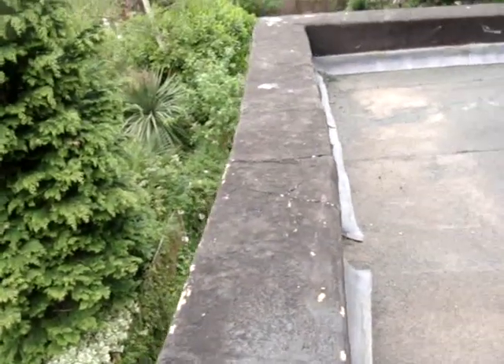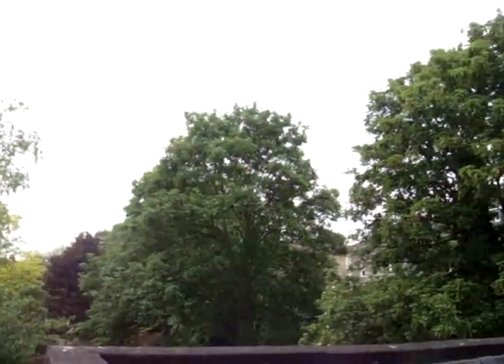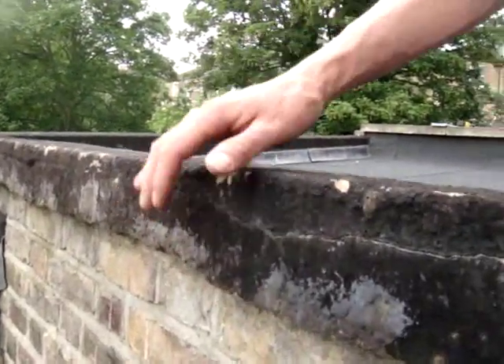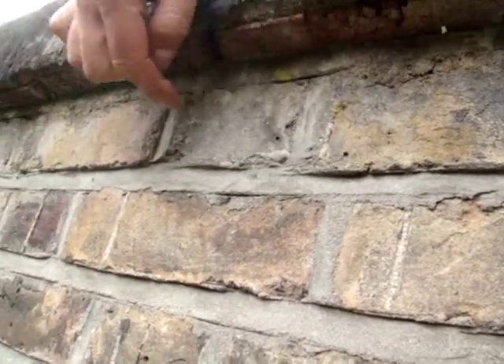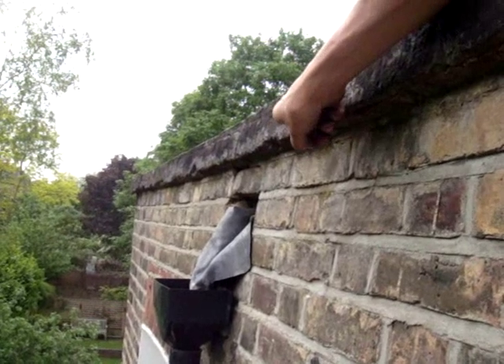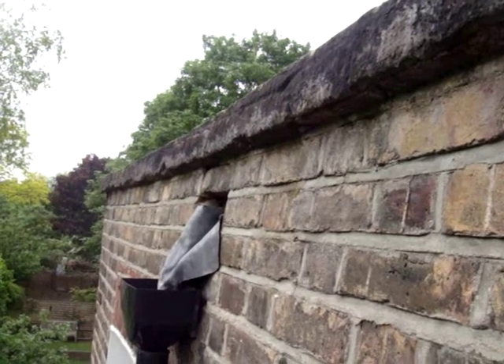Like most things I see, it's the parapet walls that cause the problem. This is an interesting scenario just here because again, looking at the drip — this is an old coping stone — and if you look at the back of it, the drip which was here is broken away; the chip is missing. Where the drip is broken away you can see evidence of water running down the wall. If you look over there, you can see it's literally green everywhere, it's divots in, and it's because of the drip not being there.